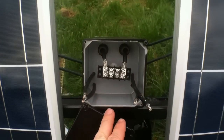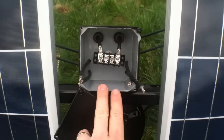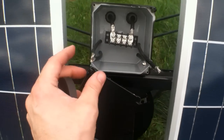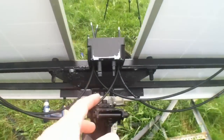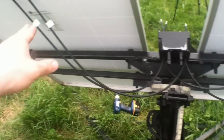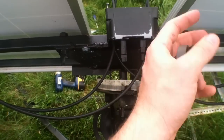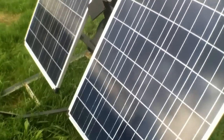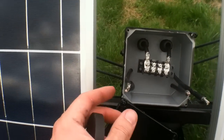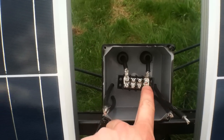Make sure you use the good marine box with moisture protection. Mount the combiner box to your cross frame, run all the positive wires to one side and all the ground wires to the other. Looking at the back of the array, you can see why I went to this trouble — no wire connectors and clutter hanging down, just two clean leads running into the box in the back and two clean leads coming off, ready to connect.